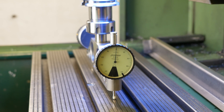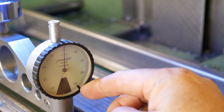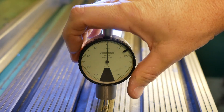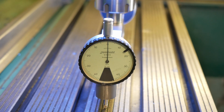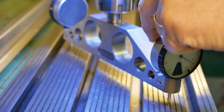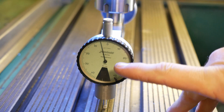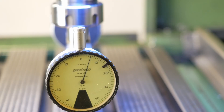So the first one is zeroed. Looks like the pointer's jammed — I can't move that independently of the bezel. I've got the clocks pretty well lined up. I can't move the marker on this one either. Now to check the tram we just rotate it through 180 degrees — just lift the pointers up. That means this side is about five one-hundredths low, and the other side should be high, which it is. Let's adjust that head.